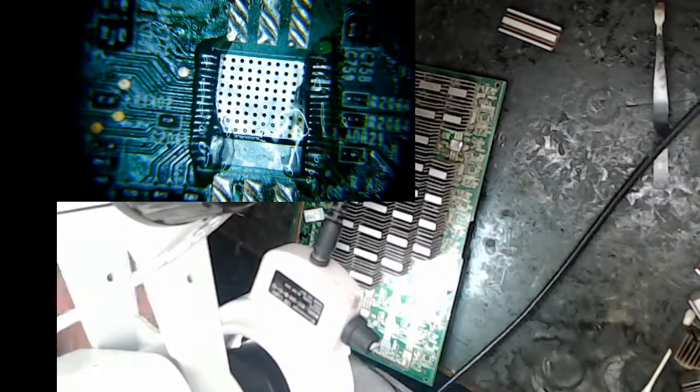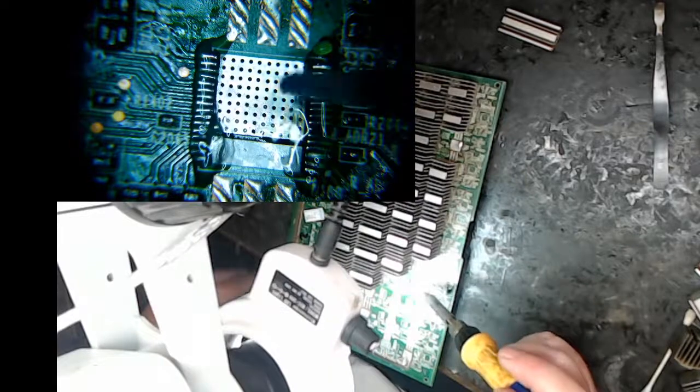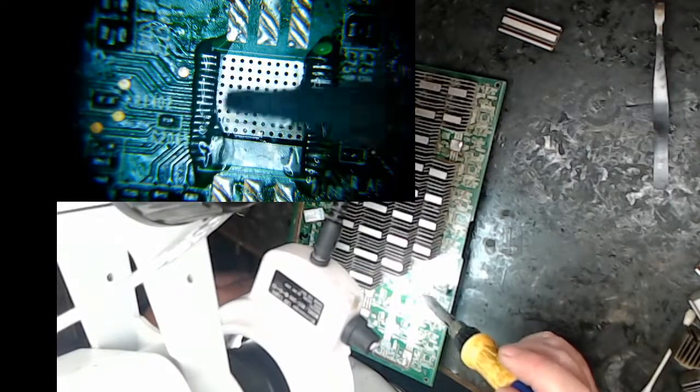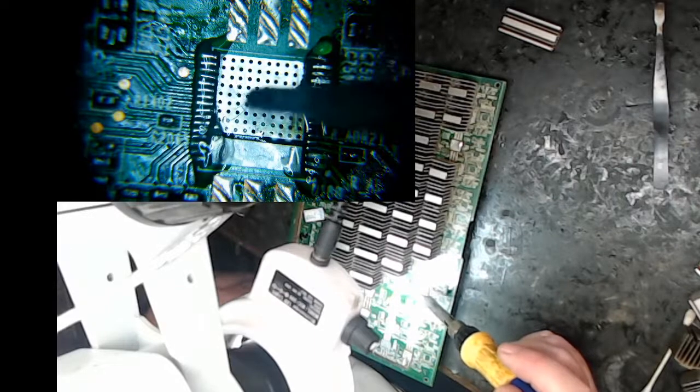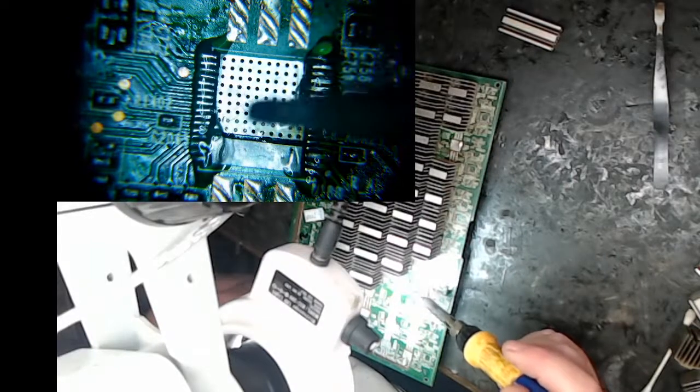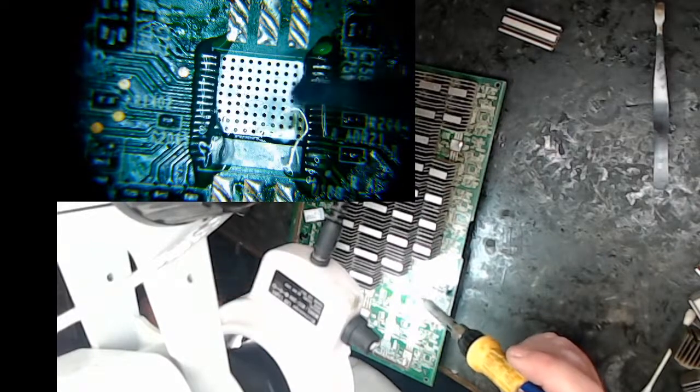It's a pain in the butt. I used to struggle with this. I'd always get it, but I'd struggle. Sometimes I'd be running my tip along, I'd come over here and leave a big blob of solder on here, and you've got to be careful. You can't just cut it off. If it's connected to a pin, you'll pull a lead out.